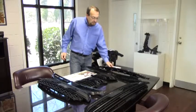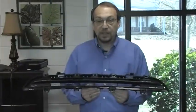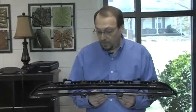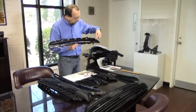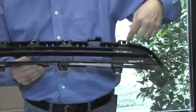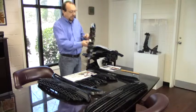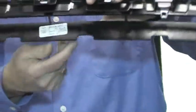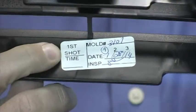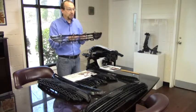Another item that specifically needs to be reviewed thoroughly when you start your job is the first piece that quality has approved and put at your workstation as a visual reference for the run. You will see that the first piece at your press will have various markings that the quality inspector has noted based on her experience and knowledge of problems and issues we've had with this part in the past. There will also be a first piece sticker on the part notifying when the part was approved, the mold number, the date, the time, and other information so that you know it's for the job you're currently running at the press.